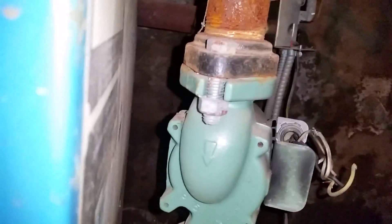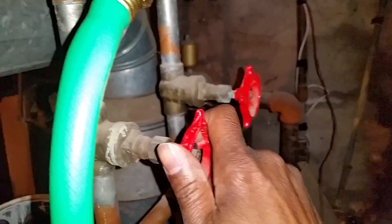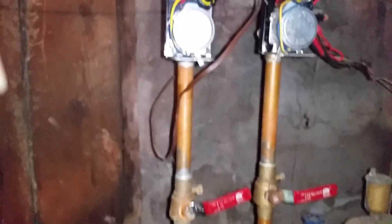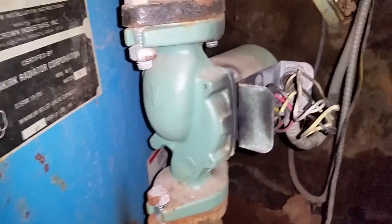When you're changing this, you want to close as many valves as you can — just remember which ones you close. These are the ones you close right here, and also these two right here. We have two zones, that's why you see two of everything. These are the zone valves up here. You close those to keep the water in the system, because once you remove the pump, some water is going to come out — most of it from the boiler. Please try to let it cool down first so you won't get burnt.